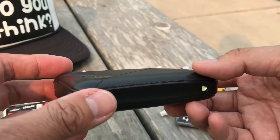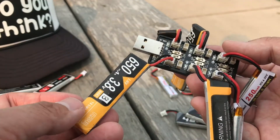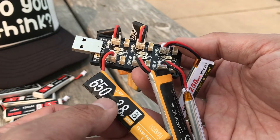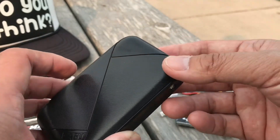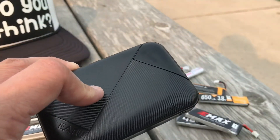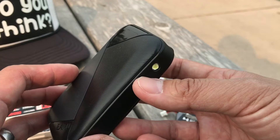Let's talk about sizing the battery bank. If I have six 650mAh batteries and want to charge twelve of them — or six of them twice — that uses 7,800mAh (650 × 12). I want a battery bank sized so that after charging twelve batteries I've used no more than 80% of it, keeping at least 20% remaining so the LiPo battery doesn't over-discharge.